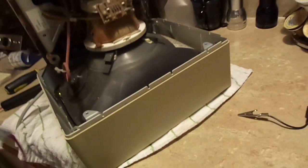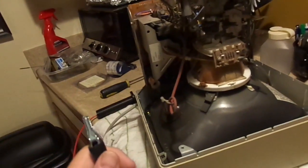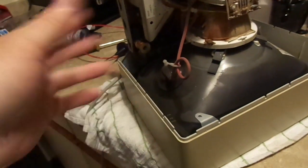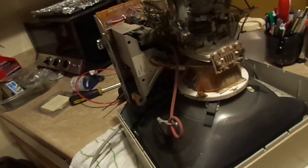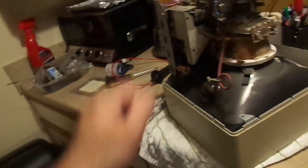One thing is important: you only work with one hand when working with a CRT, not two. Because if you accidentally touch the chassis ground and the aperture or any charged component, the voltage can be sent straight through your heart and can stop it cold. You can take a shock with one hand, although it's not recommended.